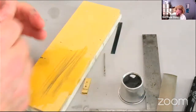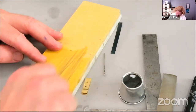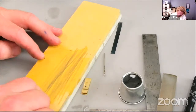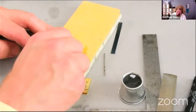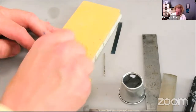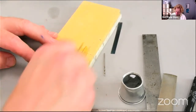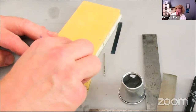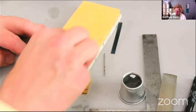Just going to do that a little bit more. Again, the thinner the web, or the thickness of the drill, the better it's going to drill. And here, unlike drilling our pivot a few weeks ago, the drill isn't going to break. It'll stick in the hole if the helix angle's too great. So I'm effectively making a twist drill into a bit of a spade drill.